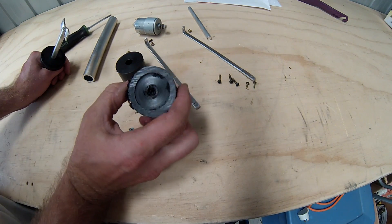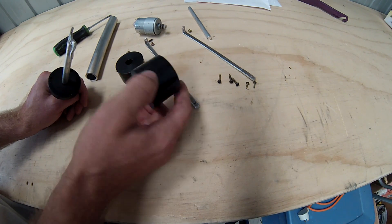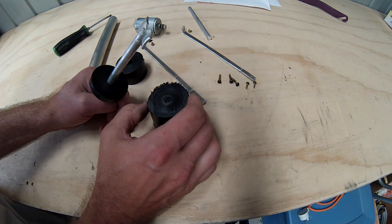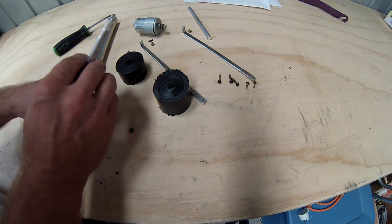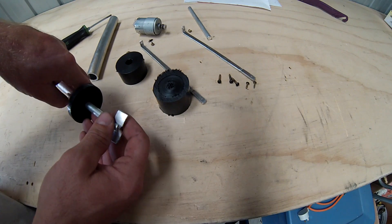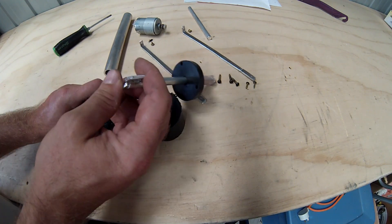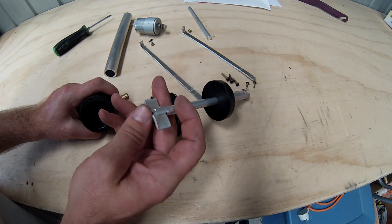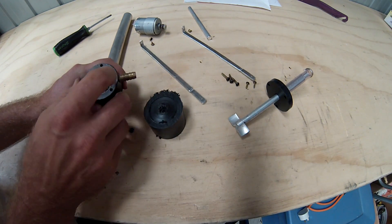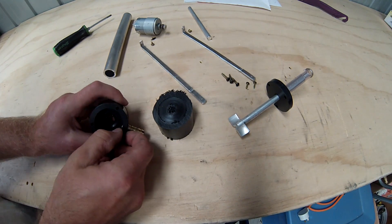For the drum, I started out with just an off-cut piece of nylon. I started out with a block like this, cut a slither off and faced up the surfaces. I've got a little lathe in my shed. I drilled a right size hole and put plenty of clearance in there because I knew it wouldn't have tight tolerances in the pump anyway. Then I bored out the inside to roughly the depth of the impeller, so it roughly fits in there. Then I bored a hole in the middle for the intake and a hole in the outside for the outlet off the pump.